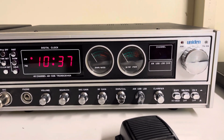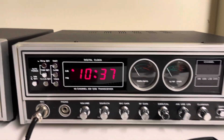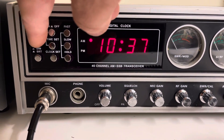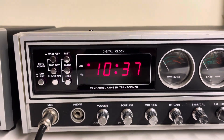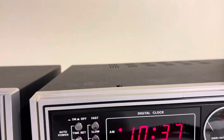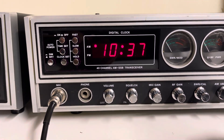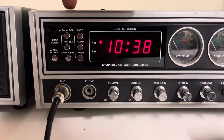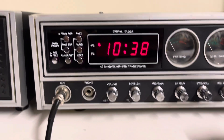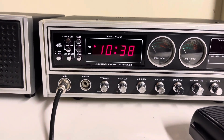All the caps were replaced and the two meter lights were changed to LEDs so they last longer. All the controls were cleaned and lubricated. One of the downfalls of this radio is that behind the faceplate there's a high-wattage resistor that gets really hot — that's what causes a lot of failures with the clock functions. The resistor is behind the front panel so it holds heat instead of being on the back of the circuit board where it can vent and cool. That's a known service bulletin from Uniden, so I had that done as well.